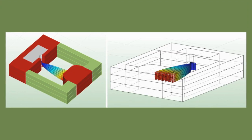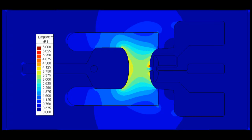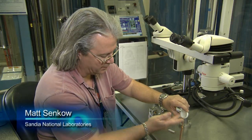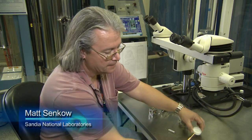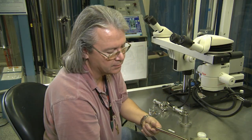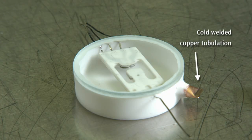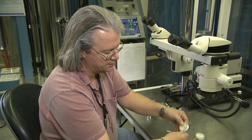The challenges we faced were mostly with the ion beam lens — figuring that out in models and then in practice. The second challenge was holding vacuum in a self-contained package. We evacuated it down to 10 to the minus 9 torr, then used a pinch-off tool to cold-weld the copper tubing, leaving the device under vacuum — giving us a testable device.